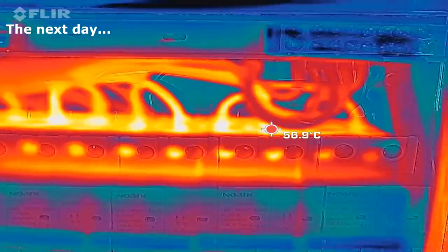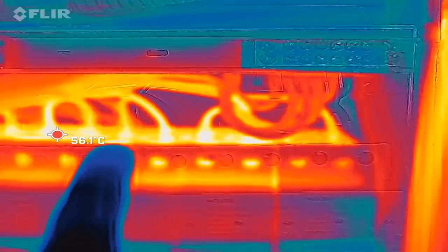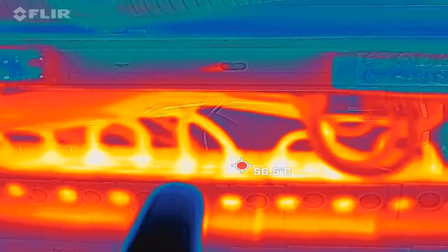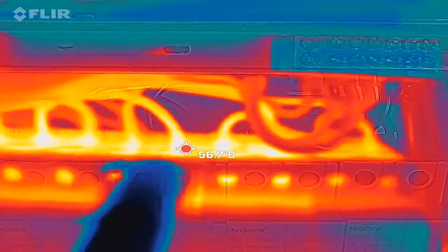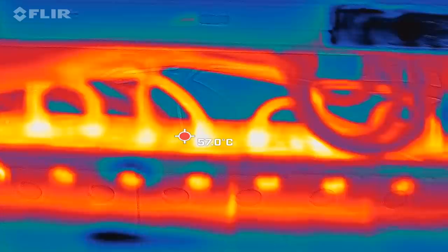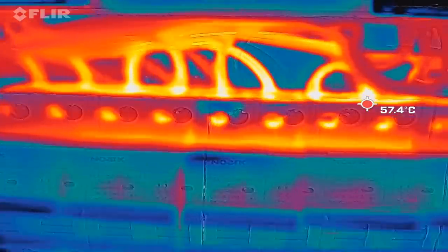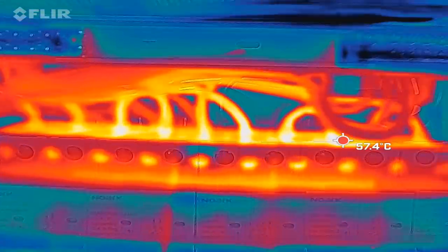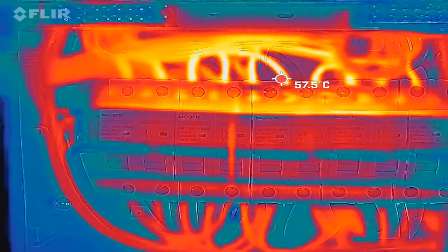We still have around 55 degrees on the east roof combiner box — no change. I replaced this cable and removed the ferrule to see if it makes any difference but it doesn't. This one is with ferrule and this one is without, and they're the same temperature — no difference either with or without ferrule. And honestly I wouldn't expect this because it's only 10 amps maximum through one of these cables. We've got 52 degrees at the bottom but again we've got ambient temperature around 38 degrees inside the garage.